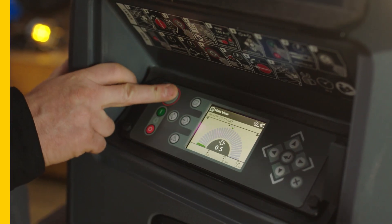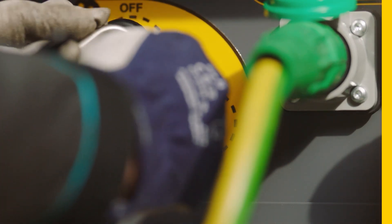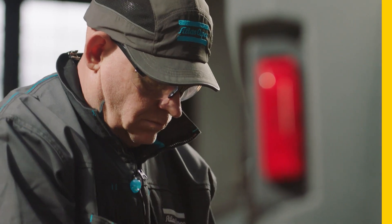When the machine is warm, turn the compressor off again. Lock the main switch — make sure the switch is in the off position. Then press the button to release the latch and put a lock into it.